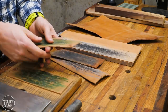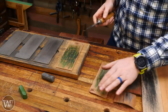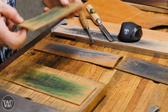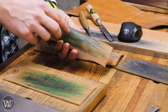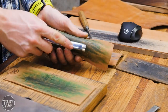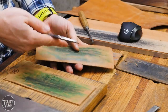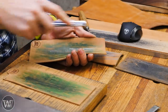The other question I get about the strops I sell on the website is why I don't have them backed onto a piece of wood — why are they free-floating? The reason is that my bench is a perfectly good piece of wood, so I can just lay this piece out, strop down, and be done. It doesn't take up any more space. I also like to be able to pick them up and bend them over. I use them as the final step in sharpening my gouges — I can bend them to the exact shape of the inside and buff out the inside. So to get a specialized fit for every one of those, whether concave or convex, you can sharpen them pretty quickly and easily just in your hand.